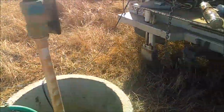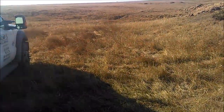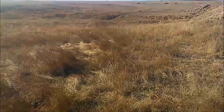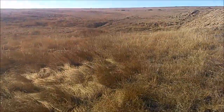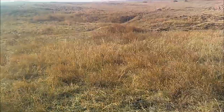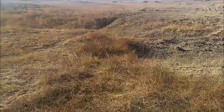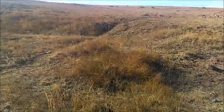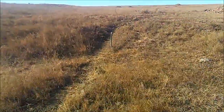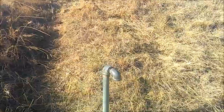The collection pipe comes out of the well underneath the back of the truck and then out across this low spot. They've got a marker pipe on the other end of it. It's hard to tell on the video but the ground level stays pretty flat out to about here and then it drops off a couple of feet. We're guessing the water level out here in this low would be maybe four feet to water, and that could change throughout the year depending on how much rain they've had.